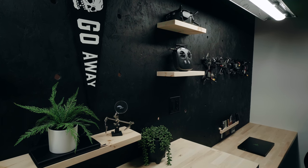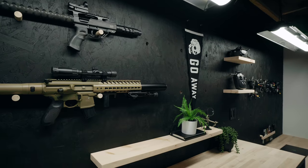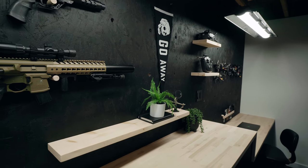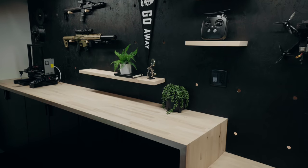The countertop is made from butcher block — basically a raw slab of wood where we made our cuts and created the waterfall edge. I opted to leave the work surface unfinished. We could have used oils to finish it like a kitchen butcher block, but it's a work surface — it's going to get banged up, and I don't want to finish it and then be afraid to use it. It's made to be used, it'll naturally patina and get worn out, and that's fine. I was actually inspired by a sushi restaurant in New York City that had a white ash bar-height table — after every evening he'd sand it and it'd be like a new surface. I've already sanded blemishes out of it. Want to see how we made it? I'll link it up here.